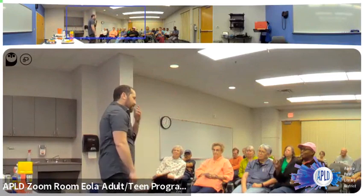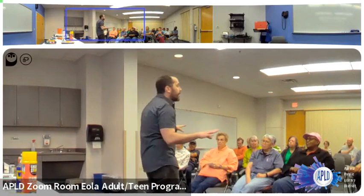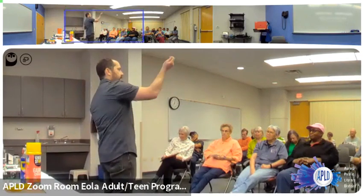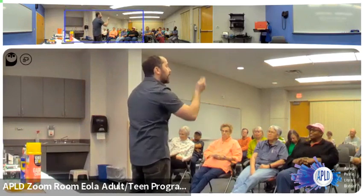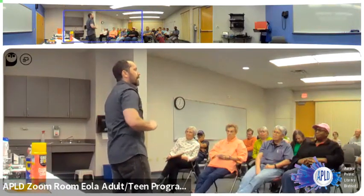Are you sanding between each coat? No. Only sand that last coat. When you come up to the dry bit after the first coat, knock off any big snots, and any little things you can see, just kind of with the putty knife, and then go back on with that second coat and that third coat. You only want to sand the last one.